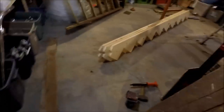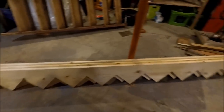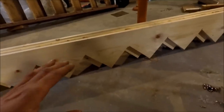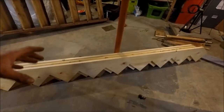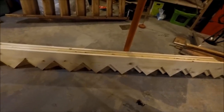I'll keep these pieces in my wood pile for scrap. I went out and bought some new lumber. This is my first time making stair stringers and I had a hard time wrapping my head around it at first, but now that I've done it I'm pretty confident. What happened was I bought 16-footers - 16 feet long, 2x12. I cut one using a 7-inch riser and by the time it got to the bottom there was about five and a half feet between the stairwell and the step, so it was way too small. I had to get rid of that piece and increased the risers from seven to nine inches - less steps, steeper grade to walk up, but I don't really have much of a choice because the stairwell is pretty small.